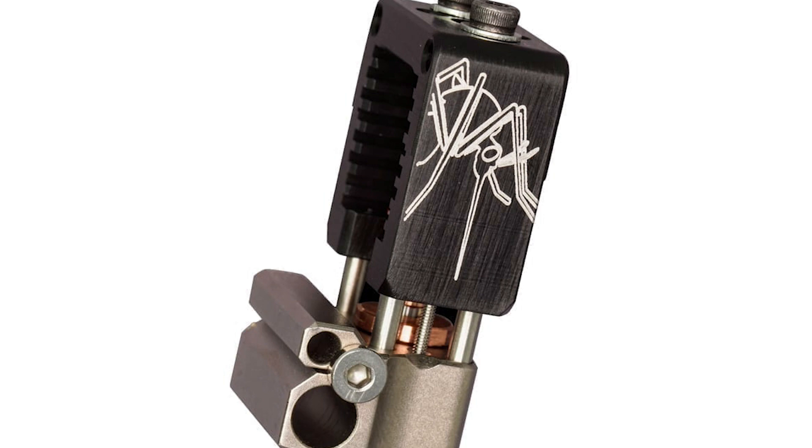Why is it so easy? Well, if you look at this picture I'm showing you at the moment, you'll see that there are four vertical risers that hold the hot end in place — the actual hot end part of it. So when you change the nozzle and unscrew it, those four little vertical shafts will hold it in place and prevent you from turning your hot end. So it is super simple, super easy. I do it hot — you can do it cold, I prefer doing it hot, but it does say you can do a cold swap. You tighten up your nozzle to a nice little finger tightness and print, and you've got no more issues.